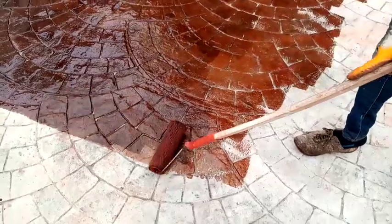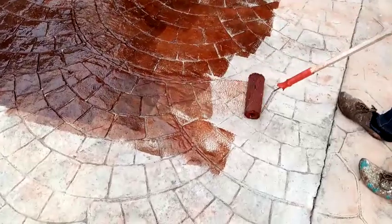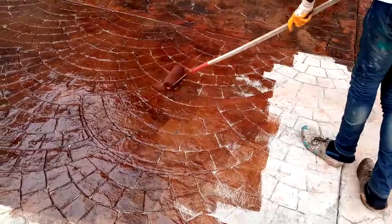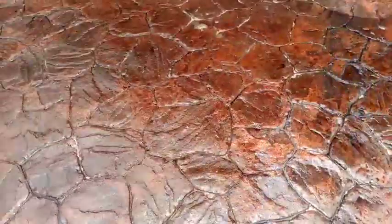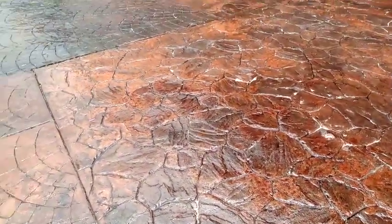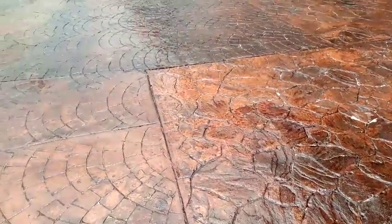This coating is meant to precede the final finish paint, which can be the Floor 2K, the Shine Floor, or the metallic floor paint. As you can see in the video on screen, that floor is a stamped concrete floor — very beautiful. That glossy finish you're seeing is not the final finish paint, not the Liquid Glass, not the Floor 2K — it's actually the EP Primer itself.